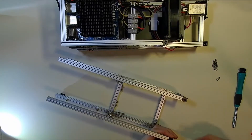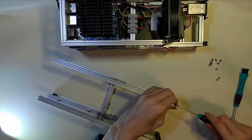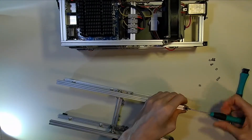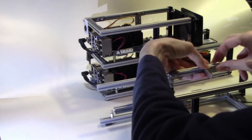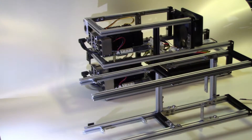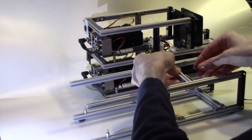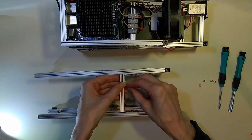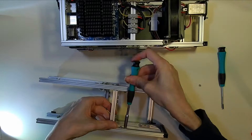The next stage is to go for level two for the second node ride. At the end of each of these 30 centimeter struts there's a small black cube, which is a novel method for connecting struts that come in at right angles. Now we're just setting up the horizontal strut here, and this will end up holding the power distribution block that takes the cables in from the power supply and distributes it to both of the Odroids. These horizontal struts also help to keep the frame quite rigid.